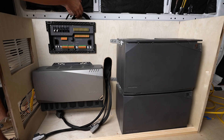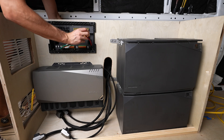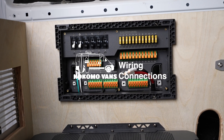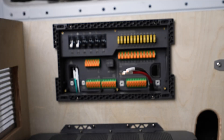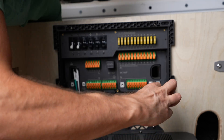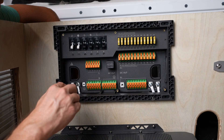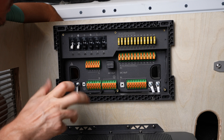Now we can start running the rest of the wires to get them in place where they'll live. They're all labeled for exactly what they'll be used for and what port they plug into. Now let's go ahead and connect the AC and DC wiring to the smart distribution panel. For the 12 volt DC out wires, use these screws. All you have to do is land the red positive wire where it says positive and then the black negative wire where it says negative. Easy as that. Now for the AC wires, use these screws. Screw the black line wire labeled L on the terminal labeled L and then do the same with the other corresponding labeled wires.